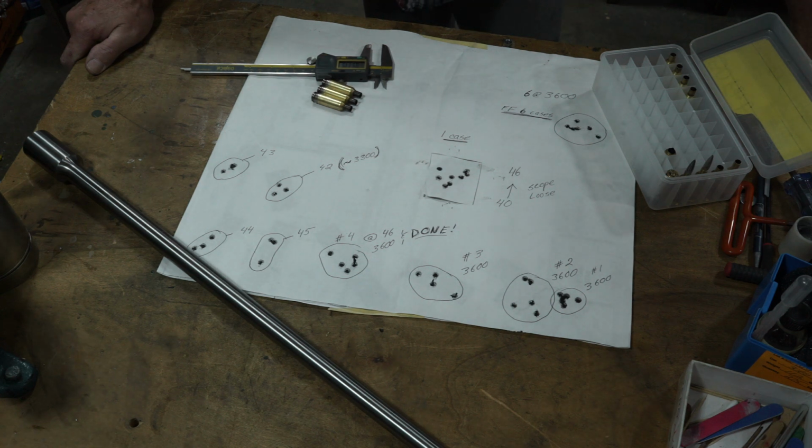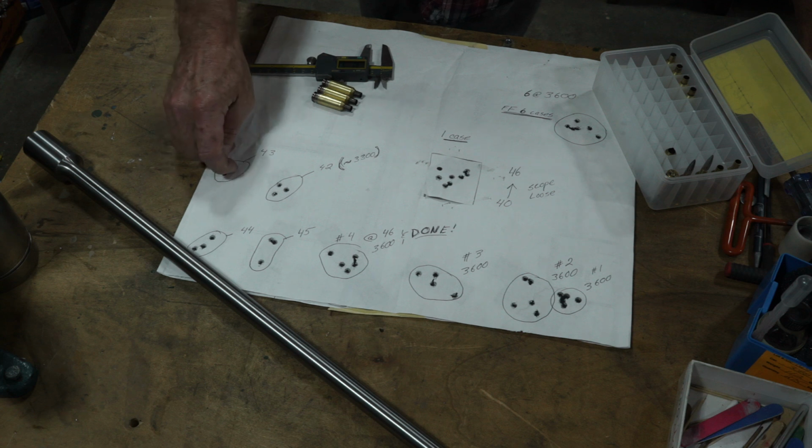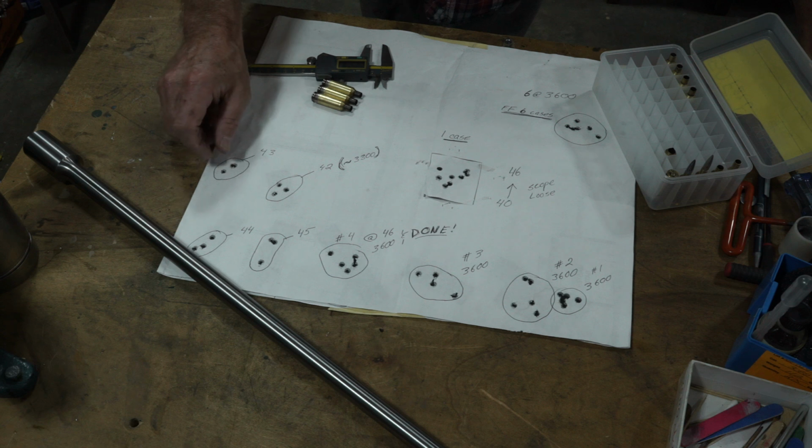Cleaned it good, making sure there's no reason that gun should not shoot. It's got a bunch of problems. It's got a bald shank. It's only got four threads on it, part of a fifth. It's got a 6/1000th thick stainless steel shim to bring it to a correct time so that it looks okay, and to set the headspace, because that has been on so many guns that I just had two guns with the same threads per inch. I don't even need to tell you the history of that bad boy. It's been all over the place.